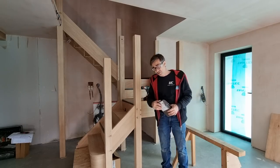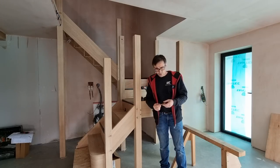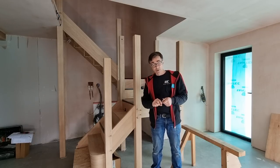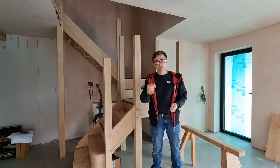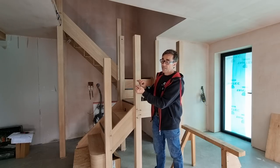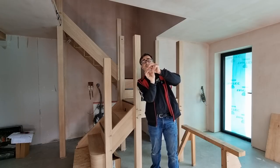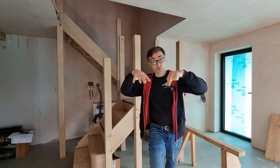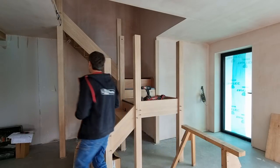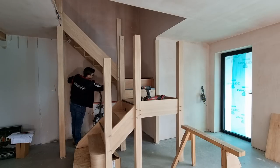I've got a preferred fixing I like to use for a staircase like this. These are actually concrete screws. Because we're making fixings into masonry, all they require is a six millimetre masonry hole - not a super bashed-out one with a hammer drill, just a nice gentle six mil hole. Because they are a through fixing - the same thickness all the way through - they'll bite into the string and into the masonry beyond. Even without a superb pull-back fixing they act like a pin, since all the force in the stair is generally coming straight downwards. My advice is put more fixings in rather than less.